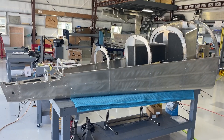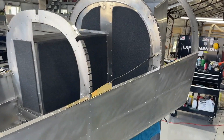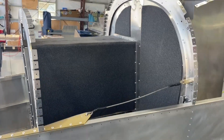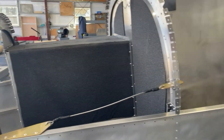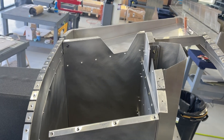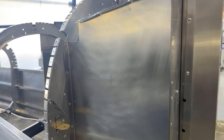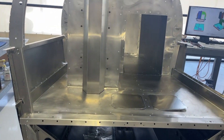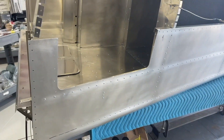The rear fuselage is about as complete as I want to take it right now. Here's what I've done so far: seat belt restraints are in, a little bit of soundproofing on the luggage extension, and the parachute box and cable tray have been installed. This right here is the rocket tube, and the floor is installed.